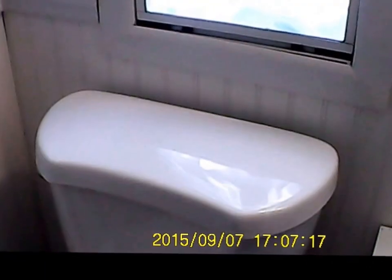Okay, we're just about done with our toilet install. I got the wing bolts bolted on there, as you can see. That's the other part. And you want it flush with this area right here. I haven't got the toilet seat mounted yet, but as you can see, when it pulls down tight on that, you stop tightening.